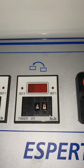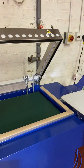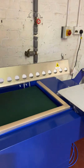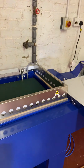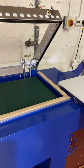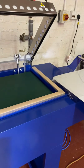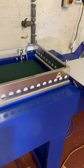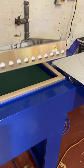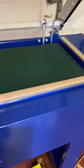So if I start the automatic cycle, auto, this can be controlled. At the moment we've got a delay of 4 seconds between cycles. You can see that there is quite a long delay. It gives the operator plenty of time to get the next pack into the seal area. So you would expect every 4 seconds a pack to be placed into the film, pulled across to the sealing area. Oh, you can decrease that as the operator speeds up. These machines can achieve 900 packs per hour.